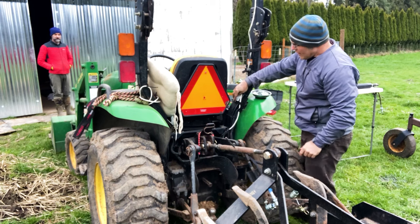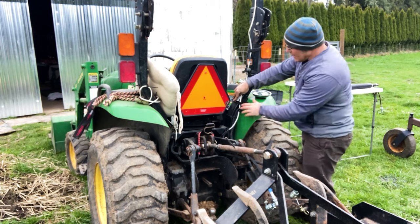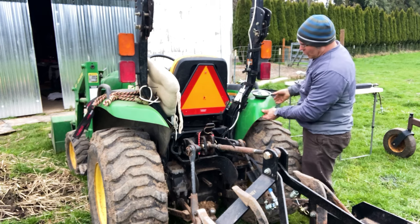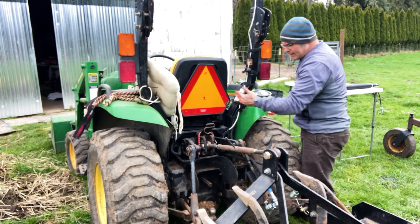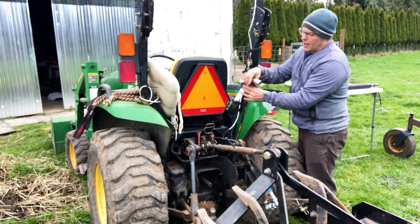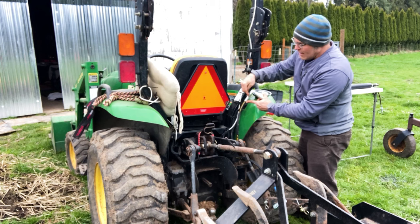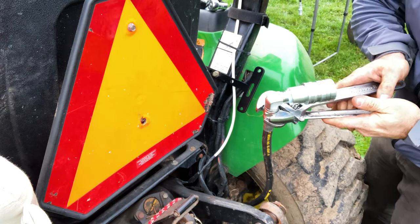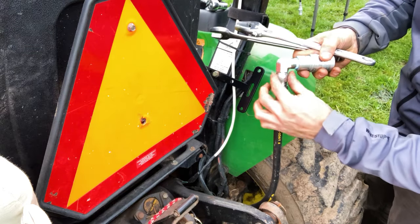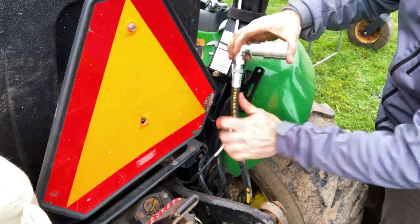This spot worked really well for us. This bolt needed a half-inch wrench, or probably a 13mm — it is a metric nut. It's nothing structural for the roll bar; it is simply holding this fender on. So undoing it there — we've got a big washer underneath the fender — we are able to bolt this bracket on. Now all I need to do is bring my hoses up, and remember these couplers are not tight yet. I'm going to hold them in place, figure out what angle that needs to be, and tighten this swivel onto the hose at that angle so that it's really nice and relaxed when it sits on there. As you tighten these — wrist tight. You don't want to put your whole arm into it. These swivel nuts just sit on three or four threads, so don't really crank it tight. It seals up internally, so just put your wrists into it.